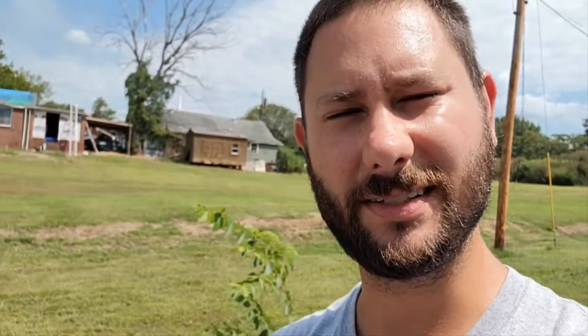If you have a brand new chiller install and it says E425, then you may simply be able to switch two of the legs of the incoming power, and that may fix your issue. If that doesn't fix your issue, I'm going to explain to you what you may have to do and what you have to check to be able to fix this issue. So let's take a look at the chiller.